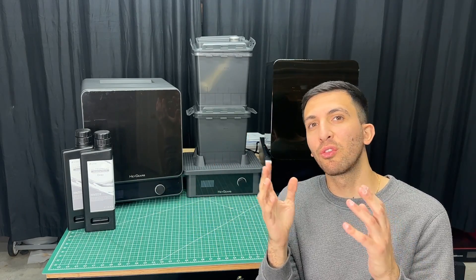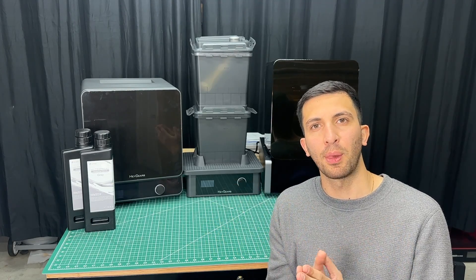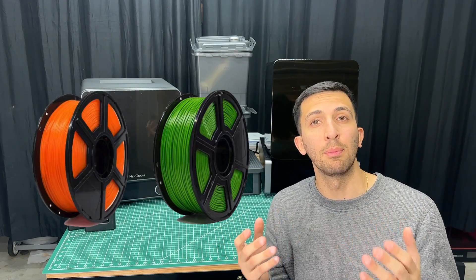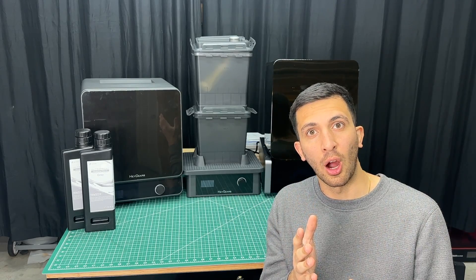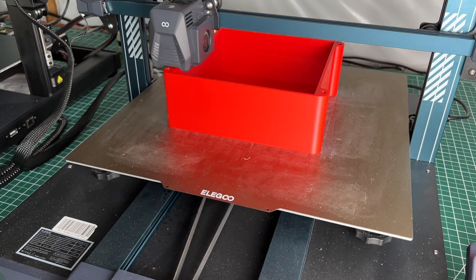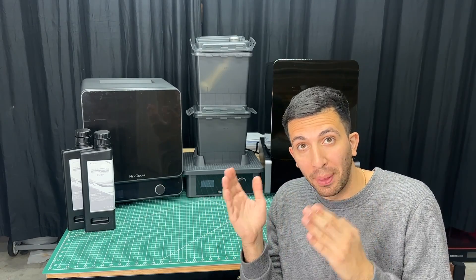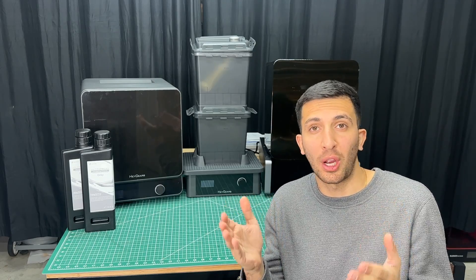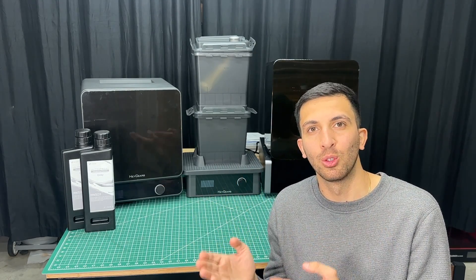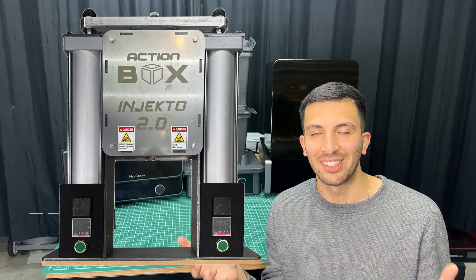There are two categories of polymers we should first become familiar with. The first is a thermoset polymer, the second is a thermoplastic polymer. Thermoplastic polymers are very common plastics like those used for making milk jugs, or perhaps you've heard of ABS and PLA if you're familiar with 3D printers. They can be heated to melt and then harden as they cool — that's how you shape them. This is the principle behind FDM printers, which heat filament, extrude it, and let it solidify. The issue for injection molding is that these plastics become soft when heated, and you can't have a mold that softens when you're injecting plastics at the same melting temperature. So to answer the most common question: no, you cannot use FDM printers to make molds for our Injecto desktop plastic injection machine.